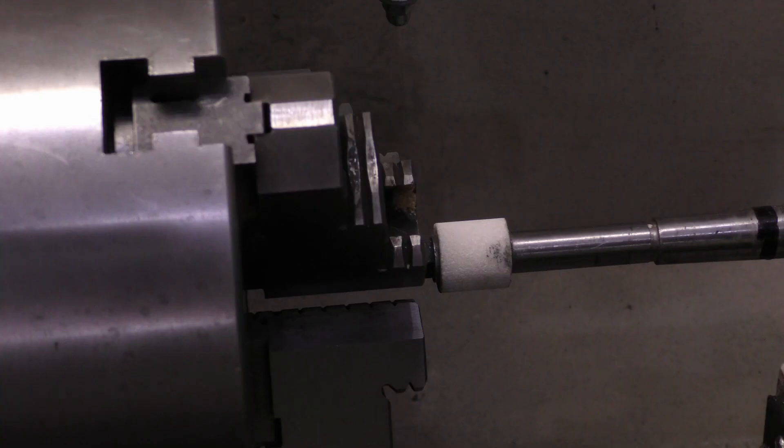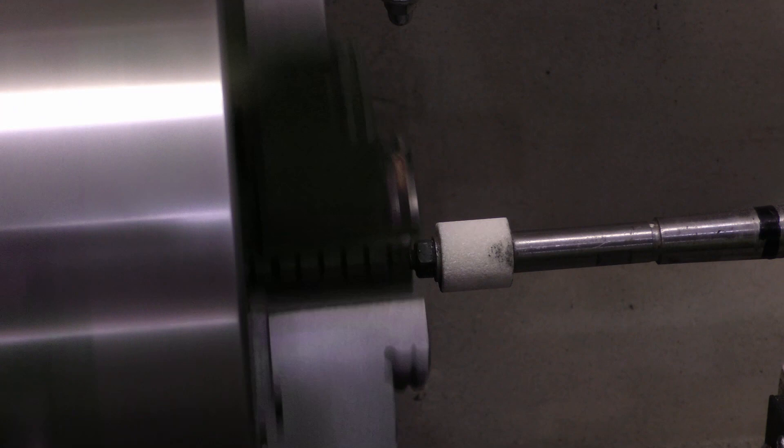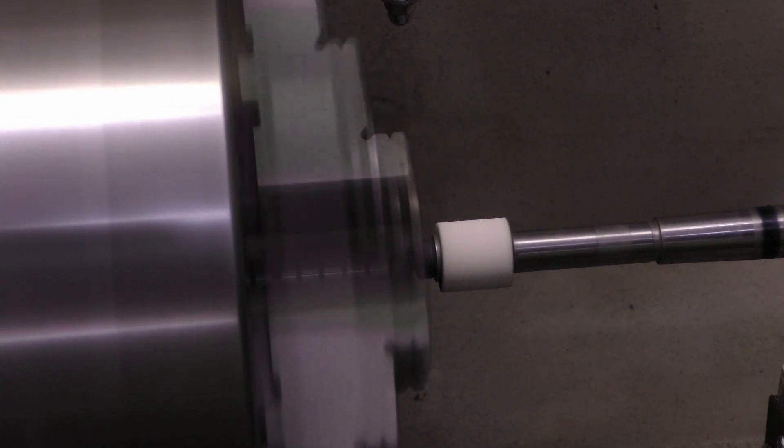Now, I think by sound I might have been taking a cut, but I don't see any color on the stone. So we're going to put the pin in it again and check our total indicated runout. The first cut was not engaging enough to get a cut. Here, I can show you how much sparks I'm getting with what theoretically is one ten-thousandths — or one-tenth — of a cut. And from other surface grinders, flat surface grinders, you may recognize all this.